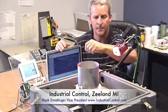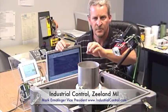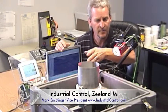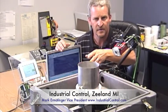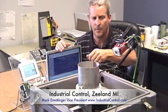It's actually a poorly done barcode because it's got some slant to it, which you don't want. It's also got underprint, which is where the cells are too small compared to the spaces in between the cells. So it makes it a little more challenging. I wanted to run this test on a can that was borderline bad.